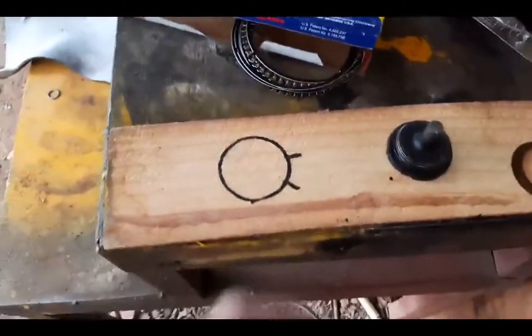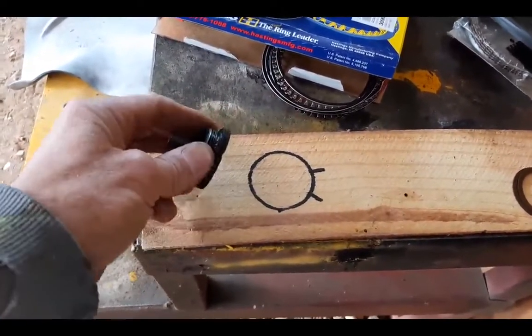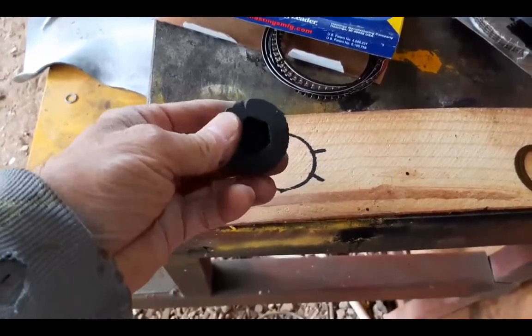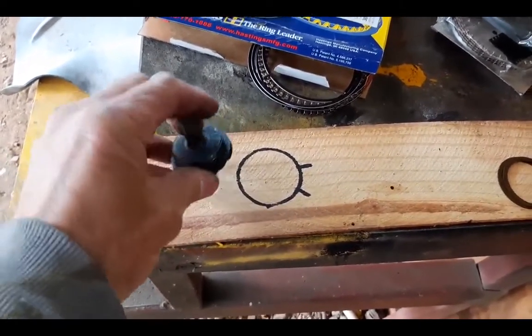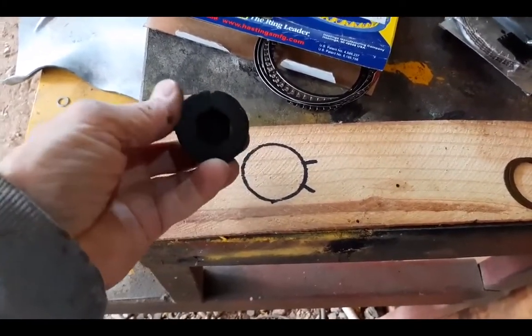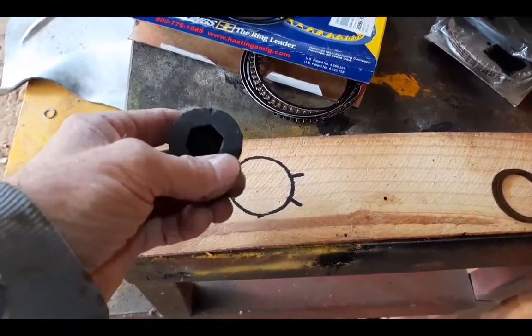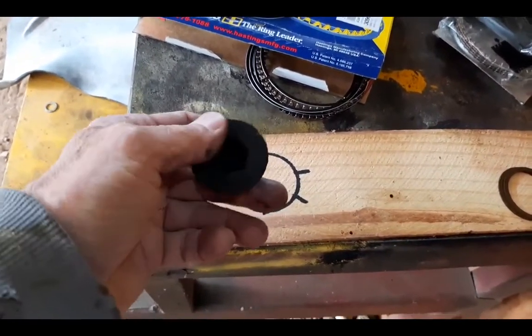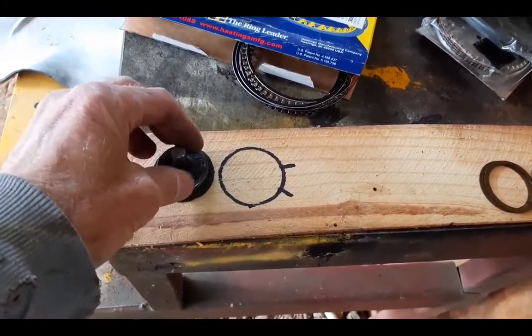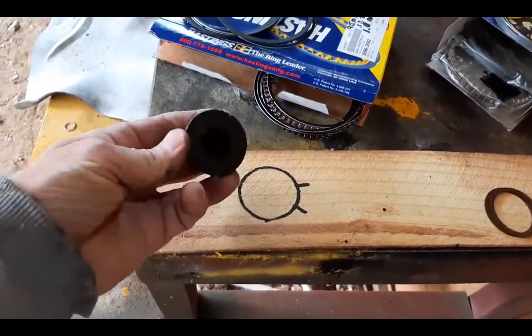This is about the thrust plug. You take the shims off the plug, then you turn it in until it's bottomed. Then you mark it with a marker or something, and then you turn it out. So you dry-fit them in, mark them, and then dry them out. Then you set your shims up and put shims on it, then turn it back in again.